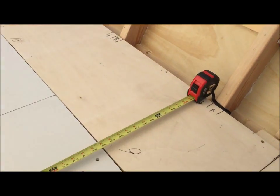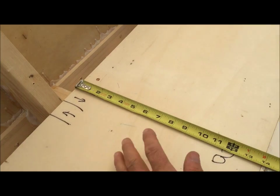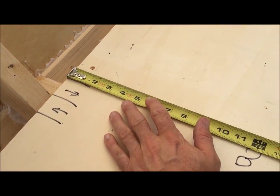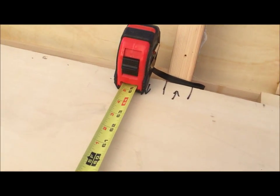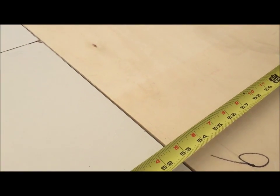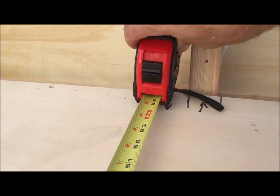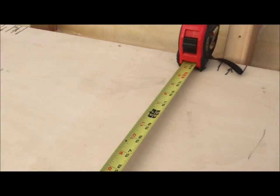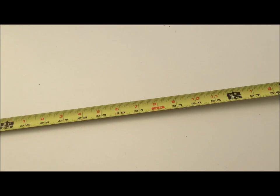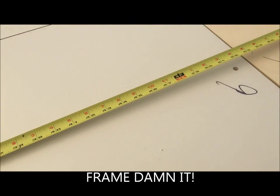Here's a little trick: instead of drawing lines all the way across, hook the tape measure on the outer edge on one side and lay the tape measure along the outer edge on the other side — make sure the tape is on the outer edge. Then just go right along just inside the tape measure across, and you've got your screws all in line for that center beam.